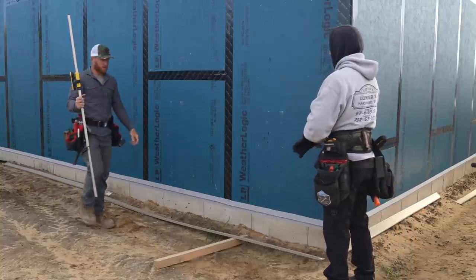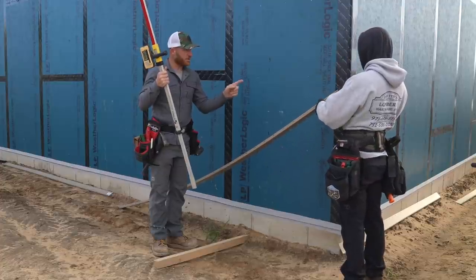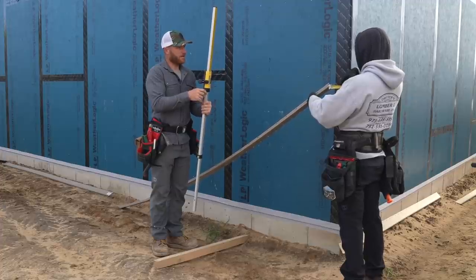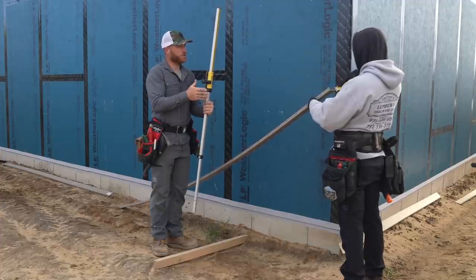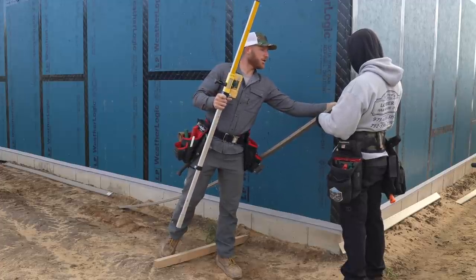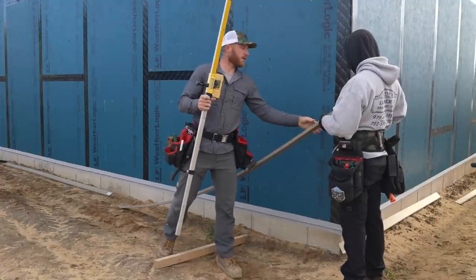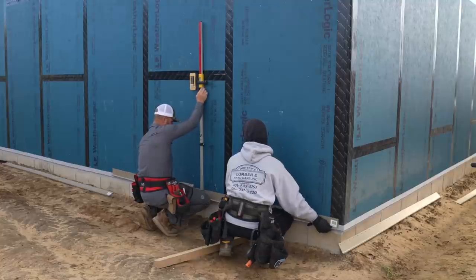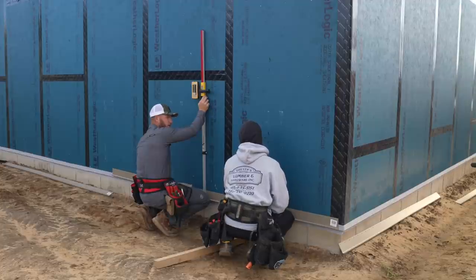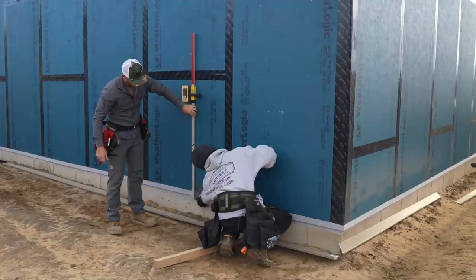So I got this receiver set at zero. This is at zero, which is an inch lower than finished house floor, which means we're gonna be a half inch automatically. I'm gonna move this. 3.5. That's total 3.5? Total 3.5, yeah. Then this little lip here, so actually then 4 inches. A little lip, a quarter inch. Imagine that we are down an inch, but we want it only down a half inch, we're gonna go 4 inches, right? If you wanna go off the top of this guy. Yeah, well that's what we're gonna probably do, and I think that's fine. So that's a quarter inch taller? Mm-hmm. So three quarters of an inch. So I'm gonna come up 3/4 of an inch. Yeah, I think we're good.